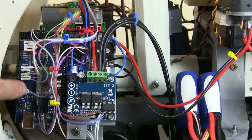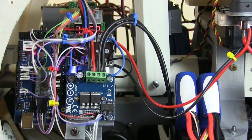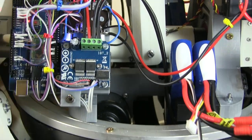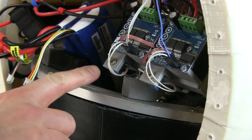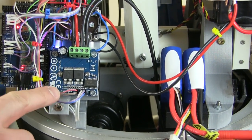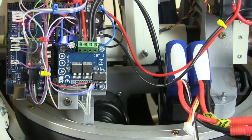I've wired in five-volt power to my motor drivers, same on the other side. Those six wires are the PWM outputs I'm going to use. Digital 2 goes to the MPU 6050 interrupt pin. For the enable wire on the motor driver, I've got Arduino pin digital 31 — there's a white wire — wired to the switches, same on the other side. That's the soft enable for those motor drivers, meaning I can switch it on digitally with a switch on the handset while also having hardware control. The other things are five volts, grounds, and the PWM inputs to those pins. I think everything is wired in — let's look at some code for the inertial measurement unit.